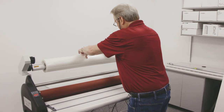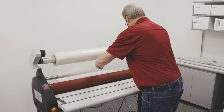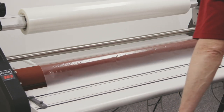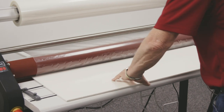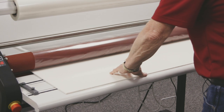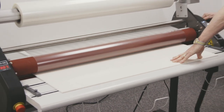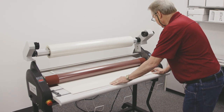I will bring my film down, go back behind the idler bar, bring it over and drape it over the heat roller like this, grab my leaderboard, bring my leaderboard in and start that into the roller. It's 3/16ths, so go ahead and set my gap on 3/16ths and start this through.